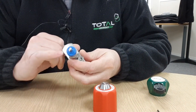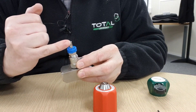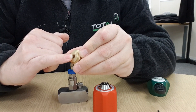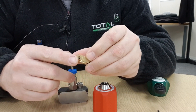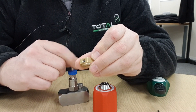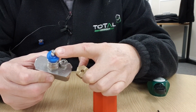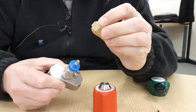You can see on the end of this valve stem there is a flat here, and we are going to use that surface to drive the valve. To do that we need an adapter. The adapter has a hole in the middle which is machined in size to match the stem of the valve, and then you can see a little set screw here — a socket grub screw — which will be used to clamp it onto the valve stem. Many different valves from different manufacturers have different size stems, so we can offer a different adapter with a different hole size to suit your valve.